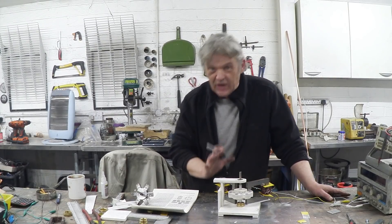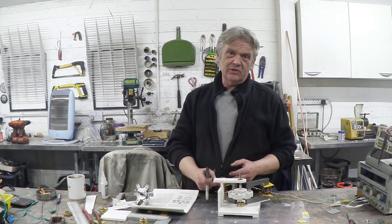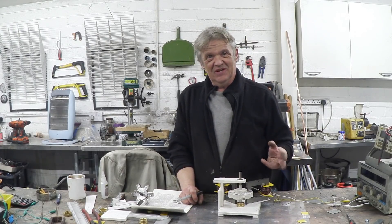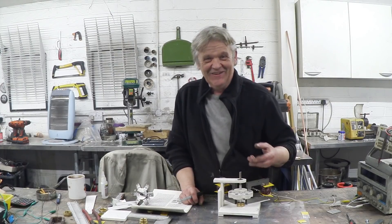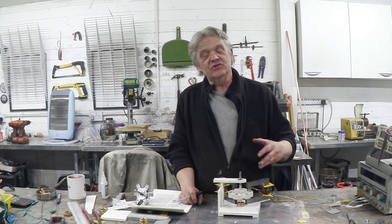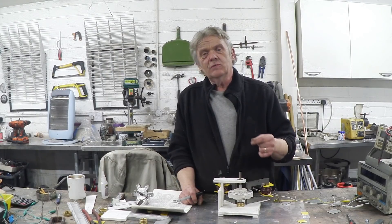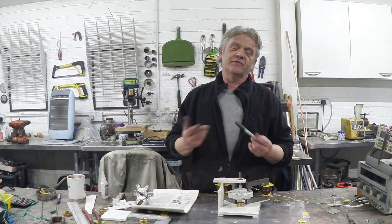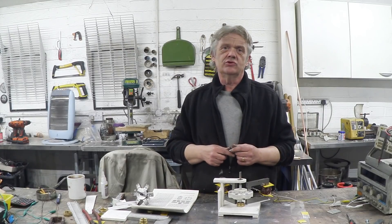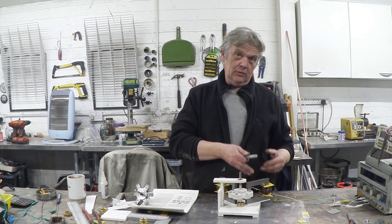We have made a change to this motor — remember, this is not just an electromagnet. What this is doing is you've got magnets on there as well; you can see them right there and right there. So this is a magnetically assisted axial flux switched reluctance motor, which is quite a mouthful, and we're going to have to come up with a new name. Switching flux and magnetically assisted motors exist by themselves — that's what the Flynn motor is. The Flynn motor uses two coils and two magnets to switch the flux.